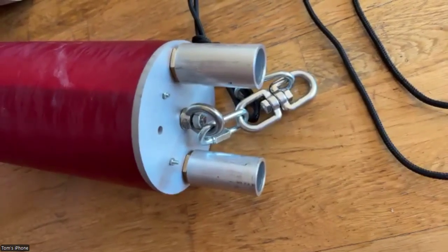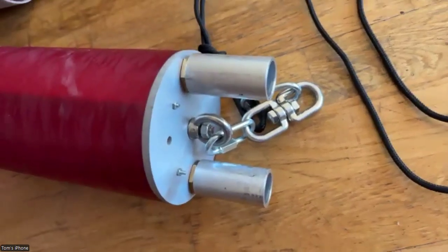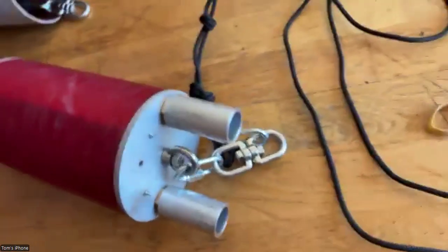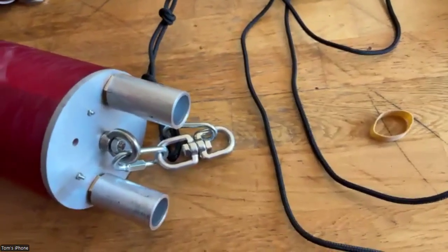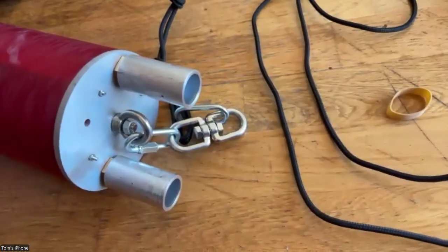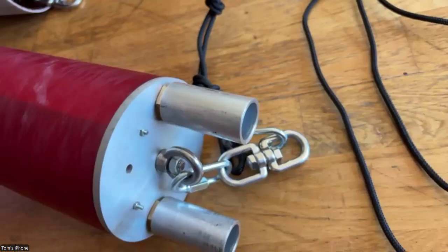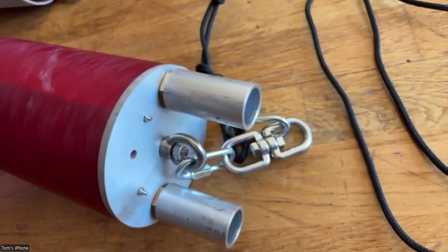So what we've done previously is made a kind of rupture seal out of just electrical tape. To ensure a better seal, we've actually got the E-matches going through the bulkhead there. On the main deployment, the E-matches all go through the top, as that's what we've done previously, and that's had good success. But we just wanted to be quite cautious with the drogue deployment at high altitude, ensuring a proper seal. So we've got them coming in through a nylon bolt, which will be epoxied, to ensure everything is sealed and there's no blowback into the avionics bay.